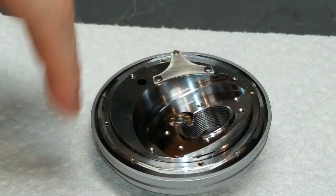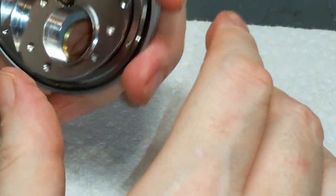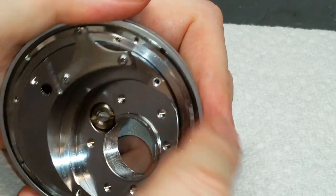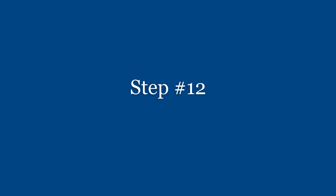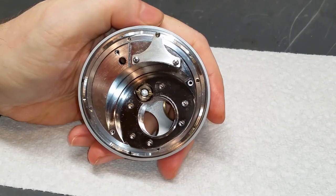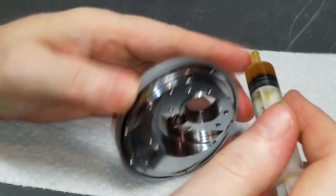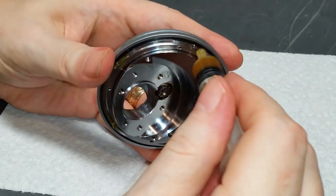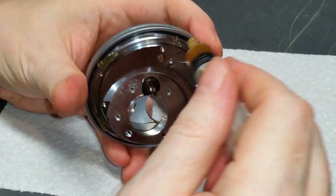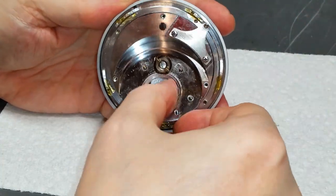What we're going to do now is grease these notches — that's the key to the life in this thing. These notches wear out primarily because they're not periodically greased. What you really should do, if you're using this scope a lot, is once a year take the whole thing out, pull this cover off, clean these little V-notches, and reapply grease to them. If you do that, this mechanism will last a lot longer. If they're heavily used — like eight hours a day in a clinical lab — I'd say maybe even every six months. There are five notches in there and they're all greased.